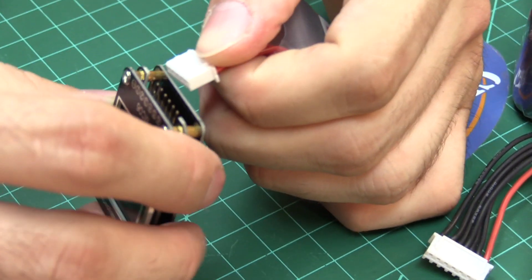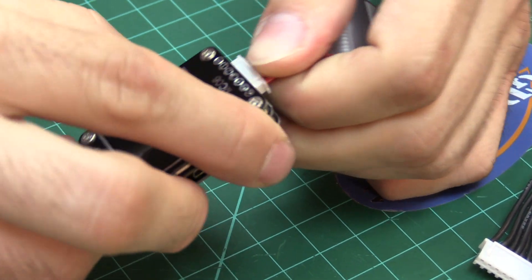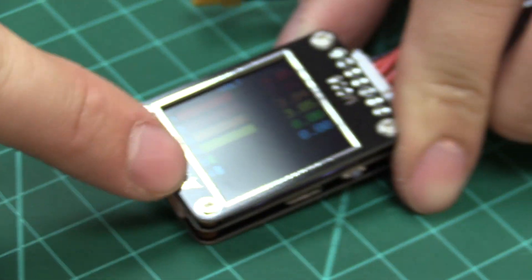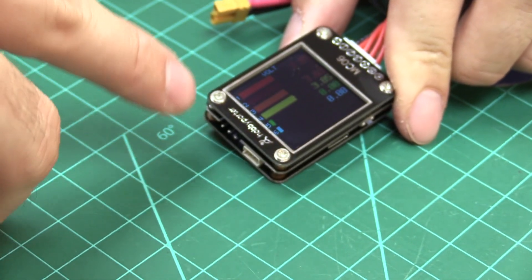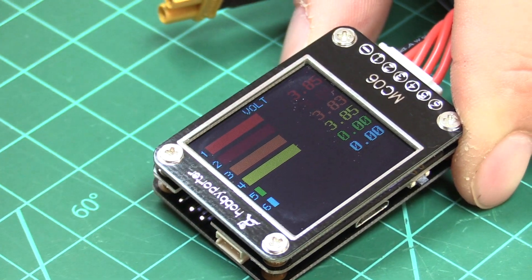If you're not using a six-cell battery, it'll take up to a six-cell battery. You go towards the minus and plug it in — so one to six cell. This one doesn't have cell five and six, so they're just reading zero. But you can see cells one, two, three, and four, and this one's pretty well balanced.